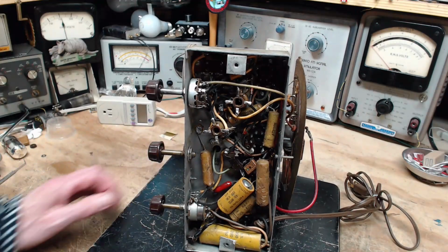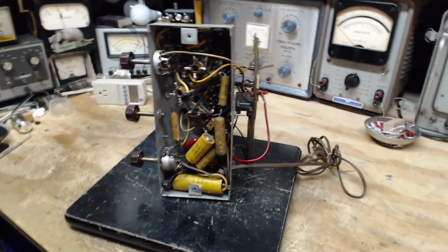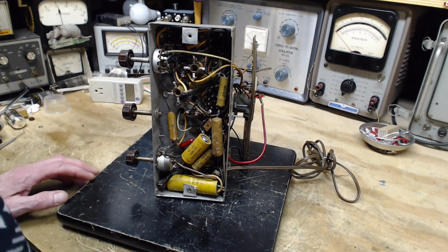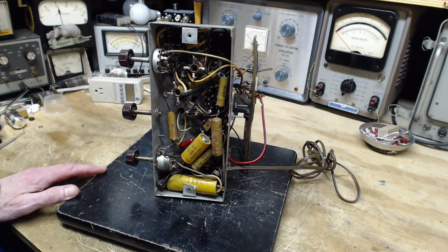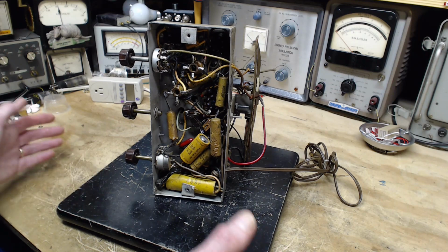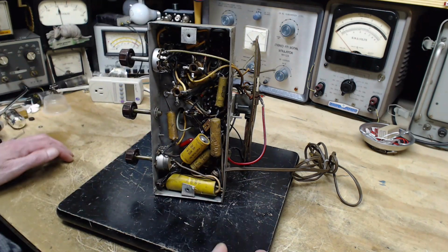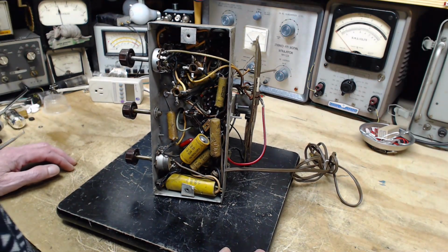This is a five tube radio. So the tubes are in series, each one dropping some of the 120 volts, and together they're dropping the whole 120 volts. Each tube taking the same current because they're in series. And typically it's the same tubes over and over. You get one of these radios, you got the same set of tubes in it. There's maybe 2 or 3 tube sets that run in these radios.